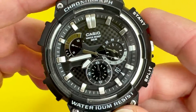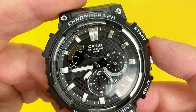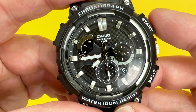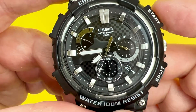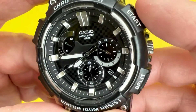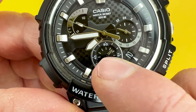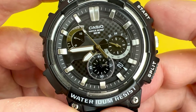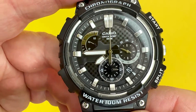I've counted five minutes elapsed so you can see how the dials work once I've done a reset on the chronograph. To start the chronograph, press the top pusher — the start button — and you can see the seconds sub dial begins working. Say something has an elapsed time of 15 seconds; once 15 seconds have transpired, you press the start button again and that will stop the chronograph.